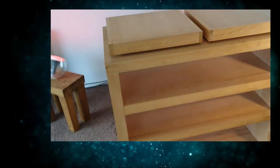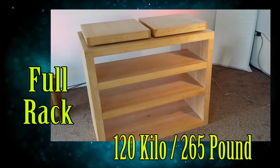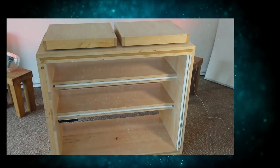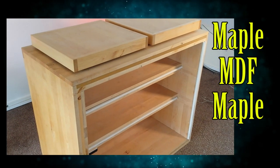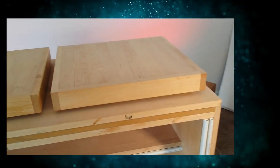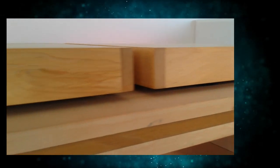Don't forget, this rack is made of real maple and MDF and it weighs in at around 120 kilos — some 265 pounds. You cannot lift this rack from the ground by yourself. You can see the sandwich construction from maple, MDF, and maple at the rear. The reason I chose this construction was two considerations. Everything goes back to vibrations in this hobby — the idea being that if you make your rack from just one kind of material, the whole rack would have the same resonance frequency, which could be an issue. By combining different materials, you could counteract that. I didn't have the equipment to measure what would work best, so I made an educated guess, since most racks at the time were made from maple. It also looks beautiful, though that is subjective. The other reason was cost — a complete maple rack in this size was more expensive than I could afford, so we used MDF for the middle layer.